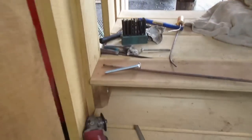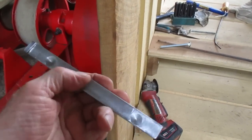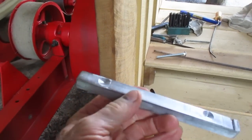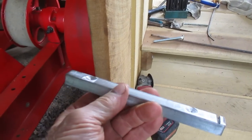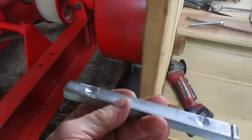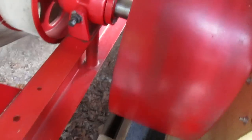I was working on this keyway, and I have it, it goes in this way. I'll show you in a minute. I cut an extra 10 thousandths off this end here, and then I put these little divots in there, so when you screw the set screws in there, which I'm just going to put grade 8 bolts in, because sometimes the Allens crank out after years.